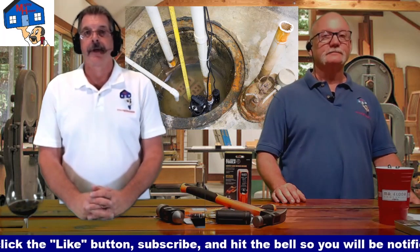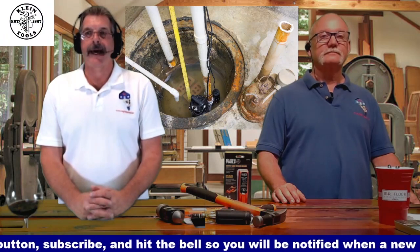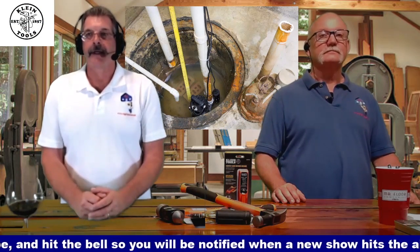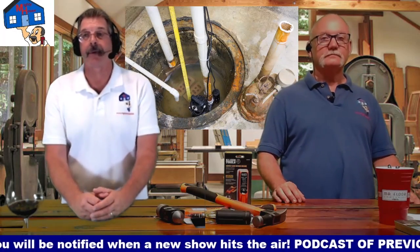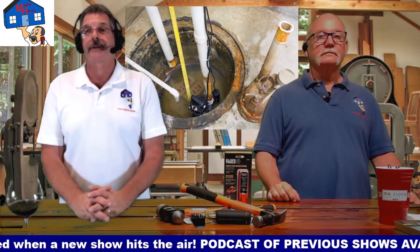Where do you set it? Usually we set them about 4 inches below top of slab, so that way the whole underground drain tile system can take as much water as it can. Right. Before your emergency pump kicks in, especially if you've lost power, because you only have a battery to run it at that point. Right. But a backup pump's really a good idea if you've got a fully finished basement.